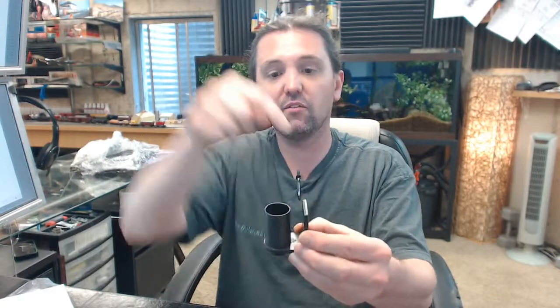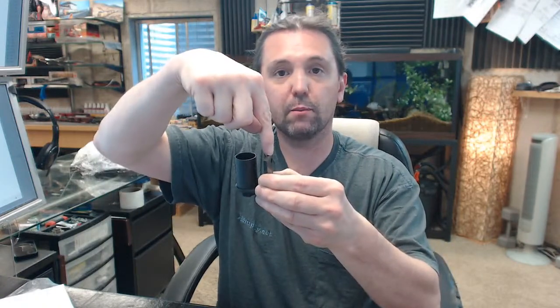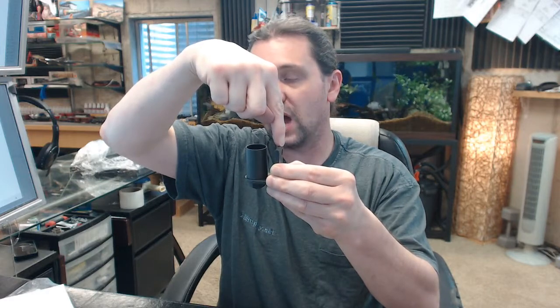And the reason that it's important to know is, again, because the vertical axis of pivoting is a fixed dimension from the back side of the bracket, the top or bottom bracket. Now, if you're going to round over the door edge, you know, the top row of tile in a bathroom is bull-nosed. Well, if you do that on both sides of the door, it becomes a radius.